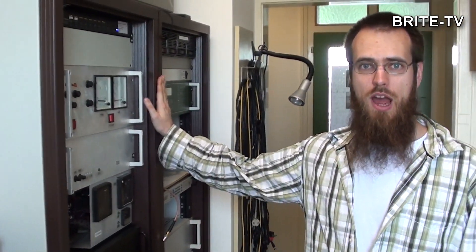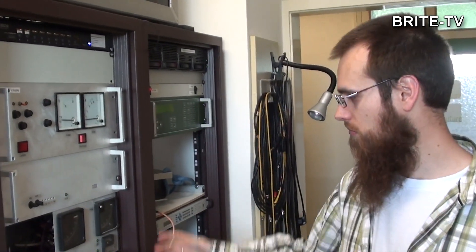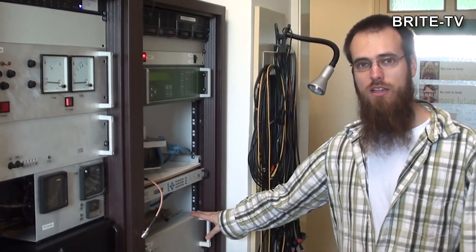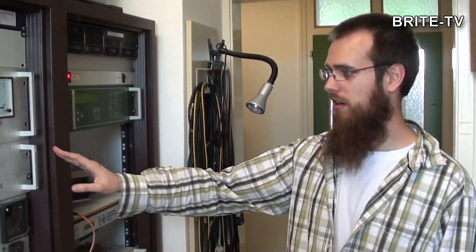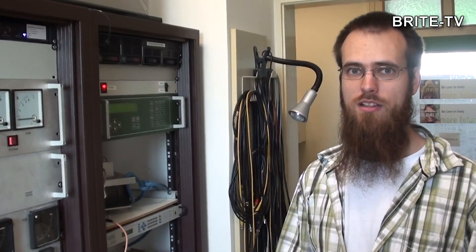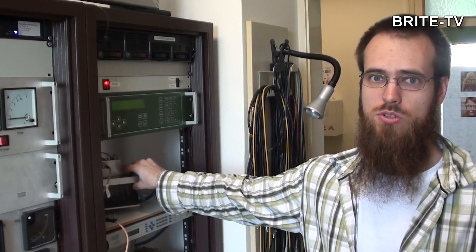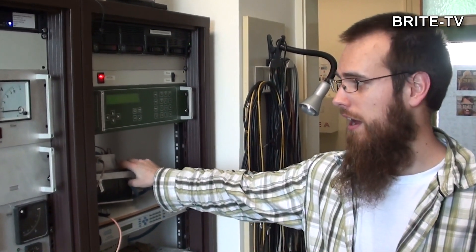As I have shown you outside, the antenna system cables come down to the back of this ground station, and in the case of the downlink are demodulated, and in the case of the uplink you have got the modulators inside. There is also a second ground station in Vienna, and some of the components like the power amplifier are currently being tested here to be used in the future at this ground station at the Sternhalde. The same is true for the S-band uplink.